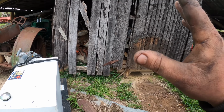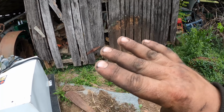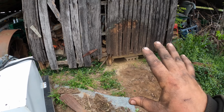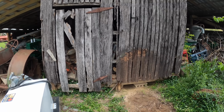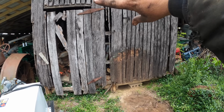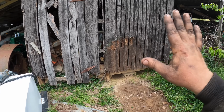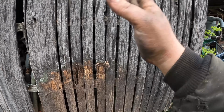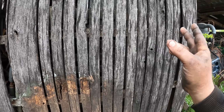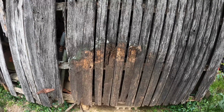And then we will start cutting our red metal, because the way this will work is the door track needs to be up first on that 2x6 with that piece of trim. And then your red metal will come down to that trim on top so that the water hits it and kicks out. And then underneath, we will cut the straight pieces to fill in between here and there and yonder. You know what I mean. So that is where we are.